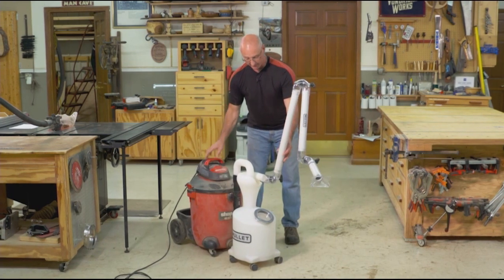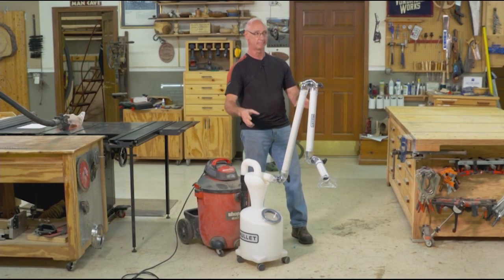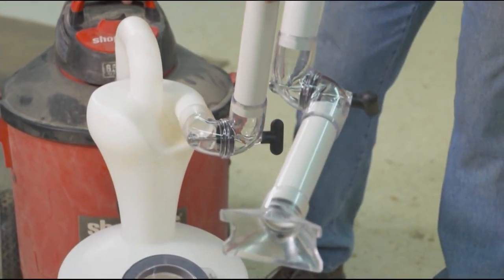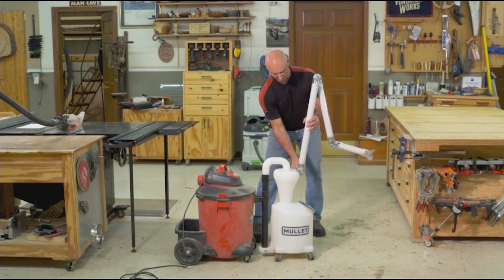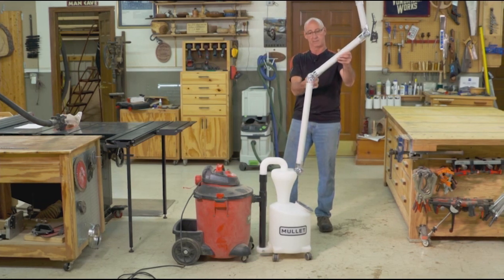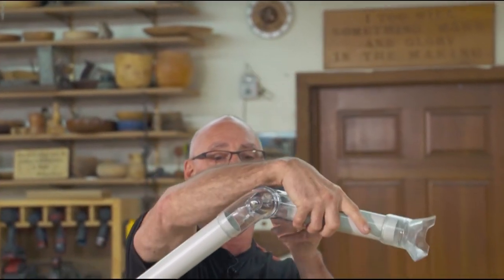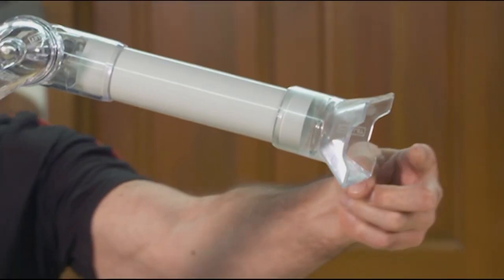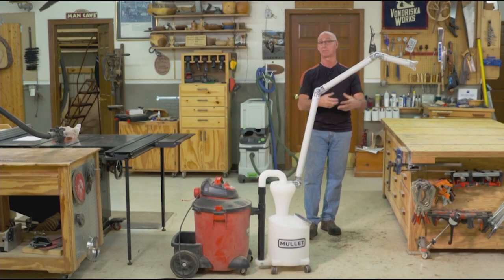Here's how this goes — in this case I've got it attached to the cyclone, though you don't have to do it that way. There are a variety of different mounting styles. There's a t-nut on here currently holding that elbow in position. When I loosen this, I can articulate the arm into multiple positions, and you can see how easy it would be to get pickup anywhere depending on what kind of job you want to get dust collection on.